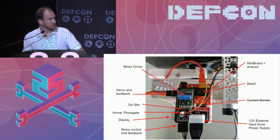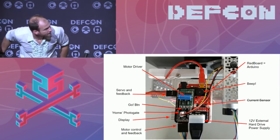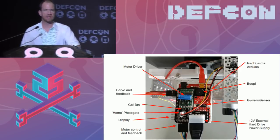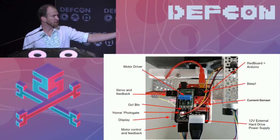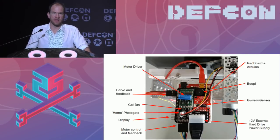Next up, we've got a display, and I'm just gonna check it out real quick. So currently we're testing 1693. So that's a 7-segment display with a bunch of segments. The interface to that display is 3-wire. So it's serial, just going to the display.